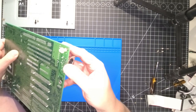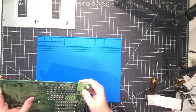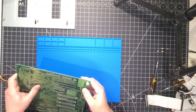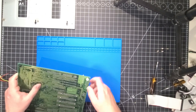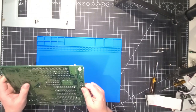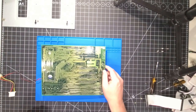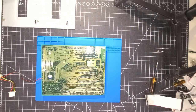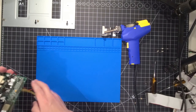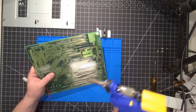I'm not seeing any issues with any of the soldered joints or high-level indicators of any sort of cracks — I realize that without an actual microscope it's harder to see, but I think we're going to be good there. I was pretty gentle taking that off by using the screwdriver. Let's get the desoldering gun now and go ahead and desolder this. Let's flip this around and see if we can remove that Dallas chip from the motherboard — making sure I'm doing the right one here.